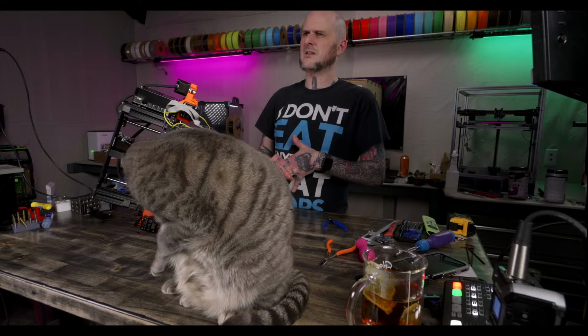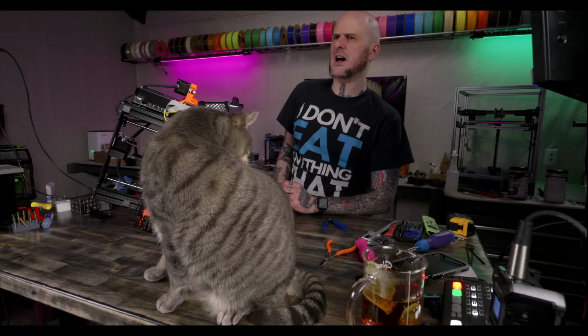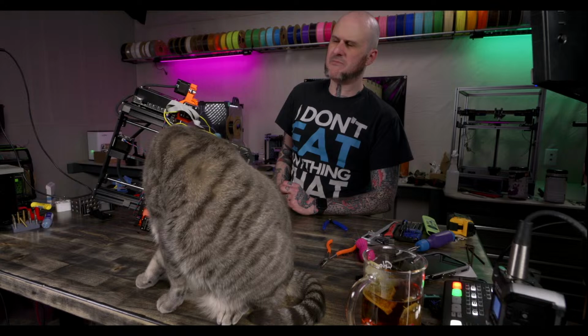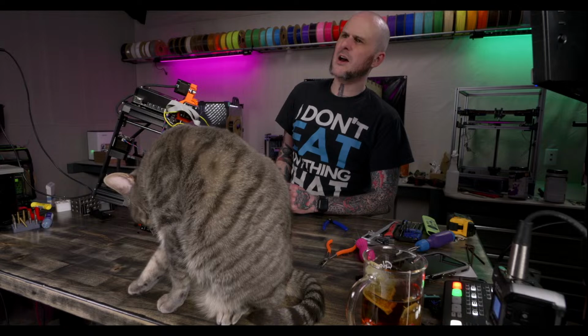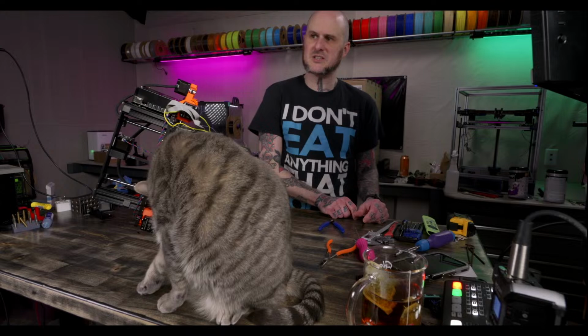I've been using one of those Creality fabric enclosures for ASA, but it doesn't help. Any workarounds? Careful doing that, it can break the tip of your tool. When they're heated up, it won't. They come right out, no problem. I run my soldering iron at like 350 on inserting and removal, so it's way above the temperature it needs to be. Oh, you broke yours doing that, your CNC Kitchen one. Okay, I'll stick to my cheap Amazon ones for that and use my CNC Kitchen ones for installation.